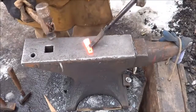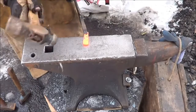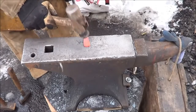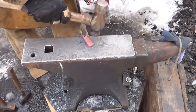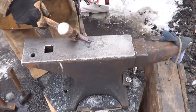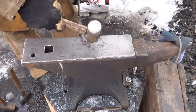Actually, there's one thing I like to do. Before I put that shape in, let's take a ball peen and just give this thing some texture right on the edge. I can't distort the edge too much because I want enough of a relatively smooth striking surface to generate a spark. But I like to rough this up because, again, sticking with the Viking theme.